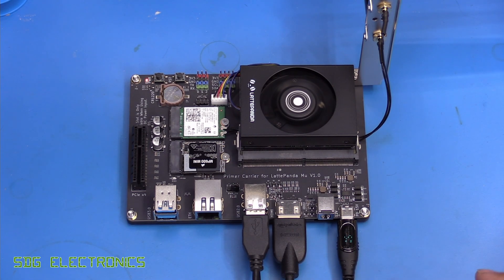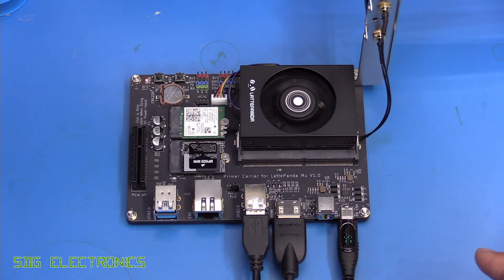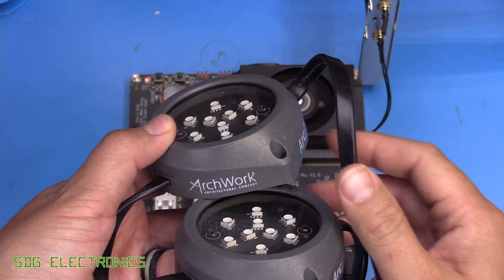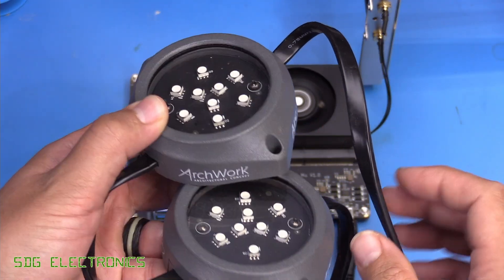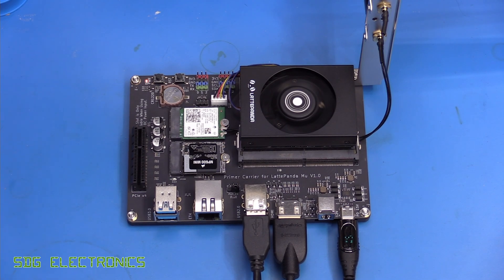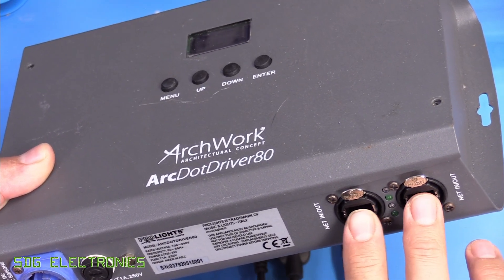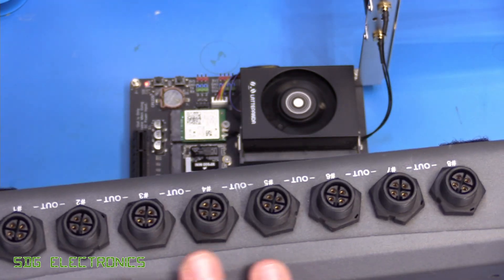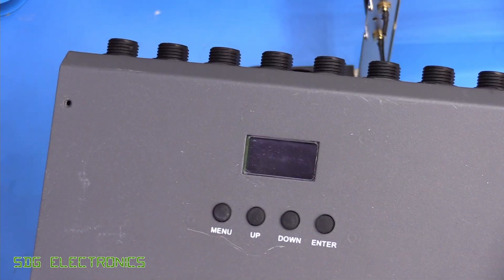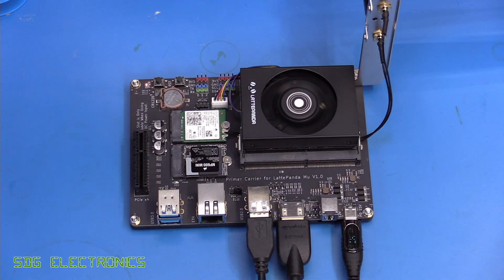What I actually want to use this for is to control some lights I bought earlier in the year. I've been busy redoing the garden for about a month and a half. I got some arch-work LED lights — about 30 to 40 thousand pounds worth of LED fixtures. These are all effectively DMX controlled from a large controller that takes an Artnet protocol, with two ethernet ports and eight different universes on the outputs. This one does have a small fault so we need to repair it, but the plan is to use it to control all the ambient lighting in the garden.